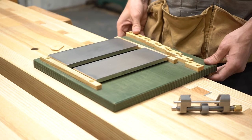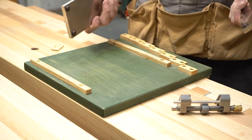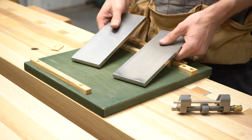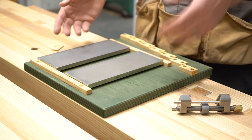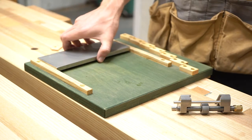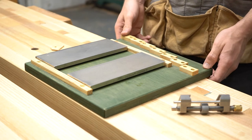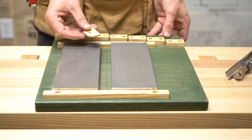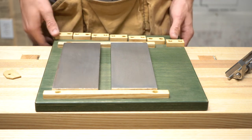I want to quickly talk about this angle setting jig — I have a link to a video in the description below if you want to make one yourself. I really love this little setup. It's got a spot for whatever stone you use. I really love these diamond stones from DMT — this is their coarse stone, just for the primary bevel, and then I like their extra extra fine for my secondary bevel, which gives me a really nice edge. I like having them here because they stay put, but they're not fixed to the jig so I can swap in something different if I need to. Down here you have different stops that give you a different protrusion length when using a honing guide, and this little piece allows you to get a two-degree micro bevel at one of these stops. Check out the link in the description below if you want to make one yourself.